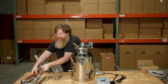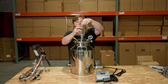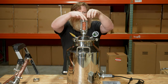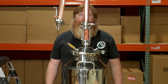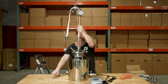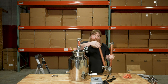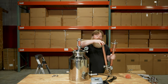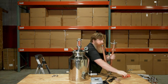Next we're going to install a sight glass. You could install this anywhere, but we're going to place it at the bottom of the column. As with all of the other 1.5 inch fittings, you'll use silicone gaskets and tri-clamps to put it into place. We're also going to pack it with some copper mesh. Copper mesh removes any sulfides that may be present in the vapor, and it also creates a thermal bridge that causes a slight natural reflux in the column, increasing the purity of the distillate. It's actually possible to increase natural reflux even further by filling the 1.5 inch column with copper packing. Installing four to six copper scrubbers will greatly increase the surface area available for condensation and reflux to occur within the column, and will also ensure that the vapor comes into contact with copper at some point during its journey up the column so the chemical reaction needed to remove sulfur byproducts occurs.